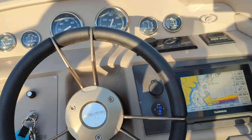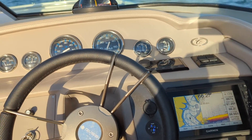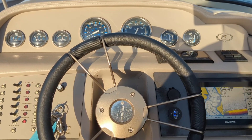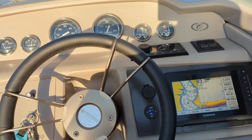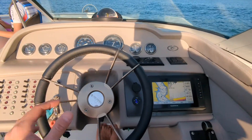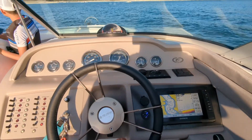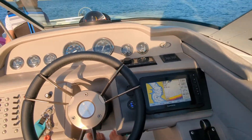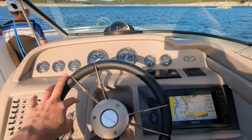A few people were asking about what sort of gauges are displayed and how it looks. It's going to be different on newer boats — on newer boats you're going to have a lot more inputs that the ECU shows the gateway and you'll be able to see all of those on your touchscreen. This boat in particular is a 1999 Cobalt 292 and the motor we're working with is a Volvo Penta 502, 502 cubic inch, 8.2 GSI — a fuel injected motor controlled by a GM ECU.